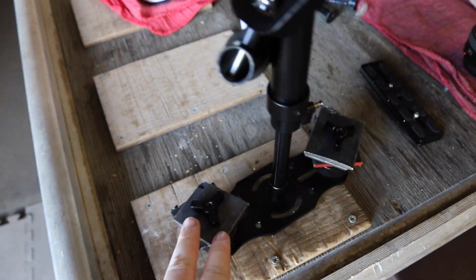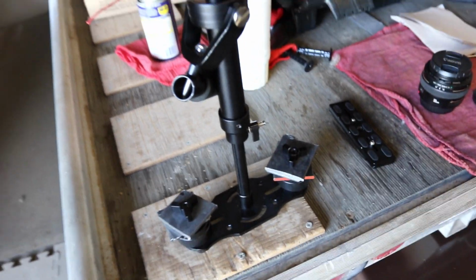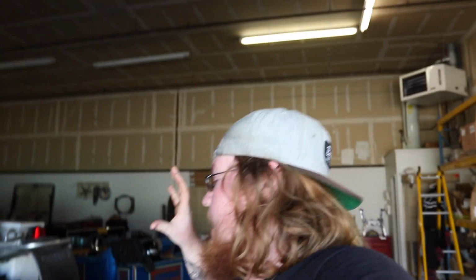I do have to say that this Steadicam operation was a success. We ended up putting 3 2x2 inch steel plates on each side, and that works out amazingly. We actually can't fit any more. They are at the bolt's extension end.